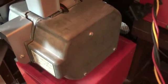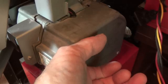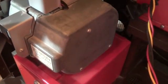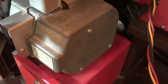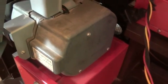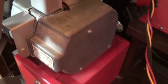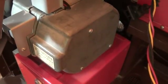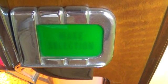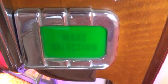Something else occurs in the coin grinder: every time someone pushes a button and makes a selection, the credit wheel will return back one notch. When it has finally returned five notches for the quarter put in and somebody has made five selections, the credit wheel is at zero and it tells the jukebox — after you've played this last record, we're done until someone else puts another coin in the slot. Once the credit wheel reaches zero, it turns off the make selection light to tell customers no more selections until you put in more money.